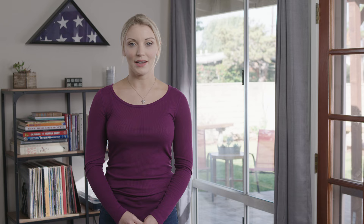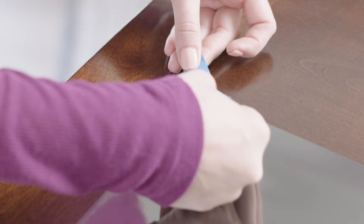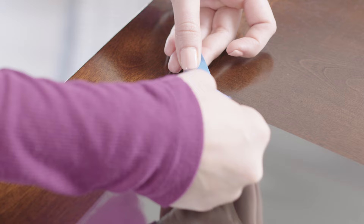The window film has two parts: the film and a clear backing liner. To remove the liner, apply a piece of masking tape to each side of one of the corners and keep them a little offset. Press the tape onto the corners firmly to ensure they will grasp the corner of the film. Pull them apart to separate the backing from the film.